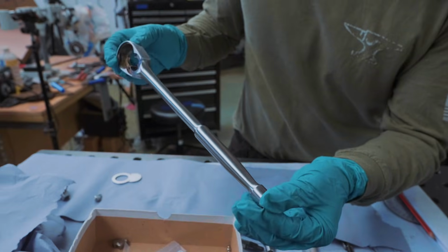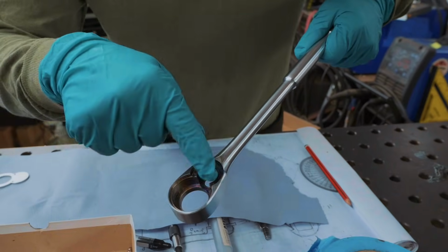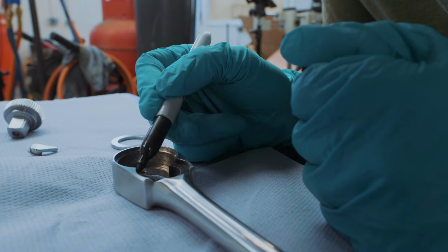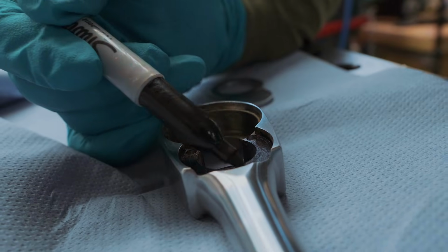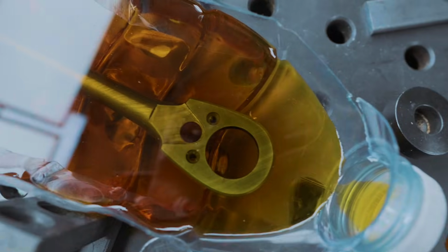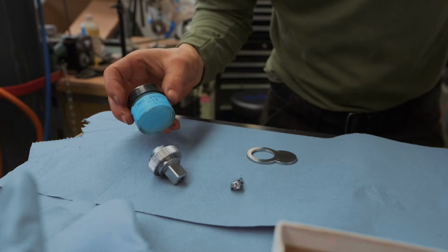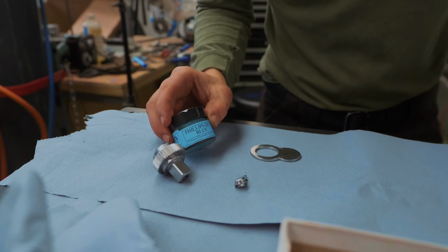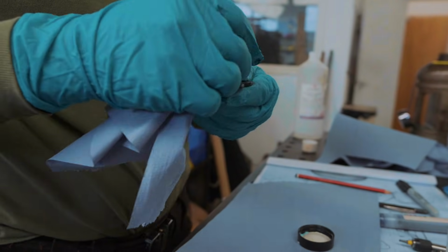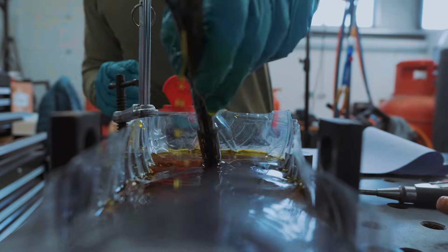At last it's time to etch the Damascus. But, I just remembered this as I spoke, these are all critical dimensions, so we are going to paint them with Sharpie so they don't etch. Right, on these components, they're not Damascus, but we're going to blacken them with some gun blue paste. This should be done now.